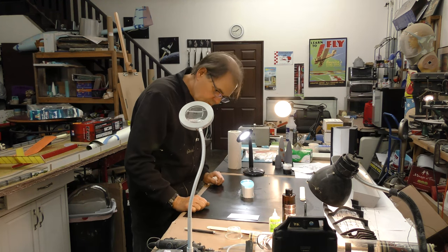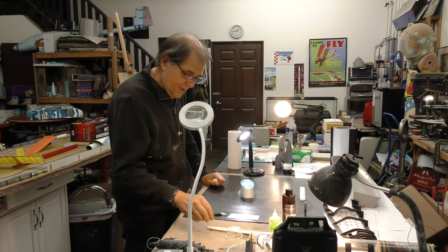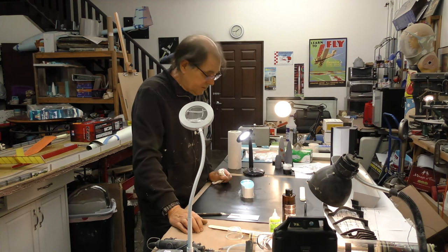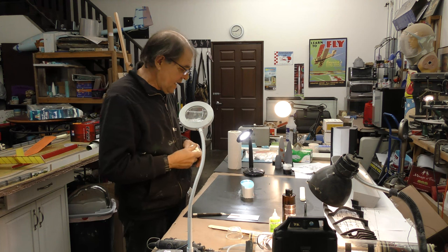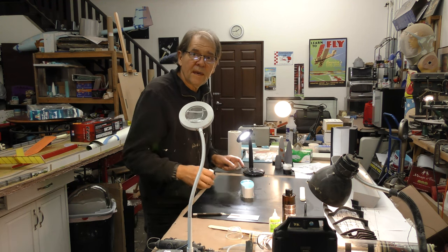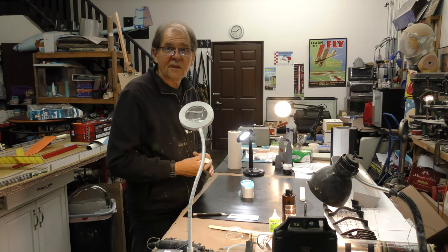There's still a bubble coming up from somewhere, and it's concerning me that there's maybe a leak and it's going down into a hole and filling up the inside of the mold. I hope not. I will be able to keep tabs on that by doing this, but I'm not seeing it descend at all, so I'm hoping we're good with that. Plus this is going to set up and eventually that will stop. Anyway, that's how I did this mold — that's not how you do a mold per se. I would highly recommend, and usually what I do, is use a clay wall around it, which you brush up. But I thought I could get away with this and I didn't. I should have used a thicker material for the base and a thicker material to go around. The idea was just to get a little silicone on there and get a nice surface coat so there were no bubbles, then wrap that around and fill it up the rest of the way. It didn't work exactly the way I wanted, but I was able to save it. So we'll see how this looks tomorrow.